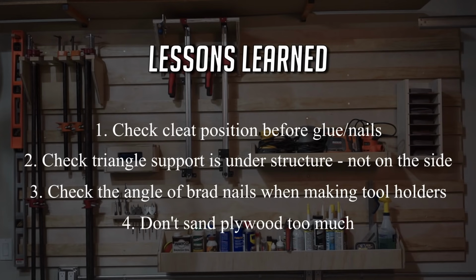And number four, depending on the kind of plywood you're working with, don't sand these too much. Otherwise, you will sand through that first layer of veneer, and you'll get a funny look if you have odd spots of different color veneer showing through. So just go real easy on the sanding touch-ups on the corners.